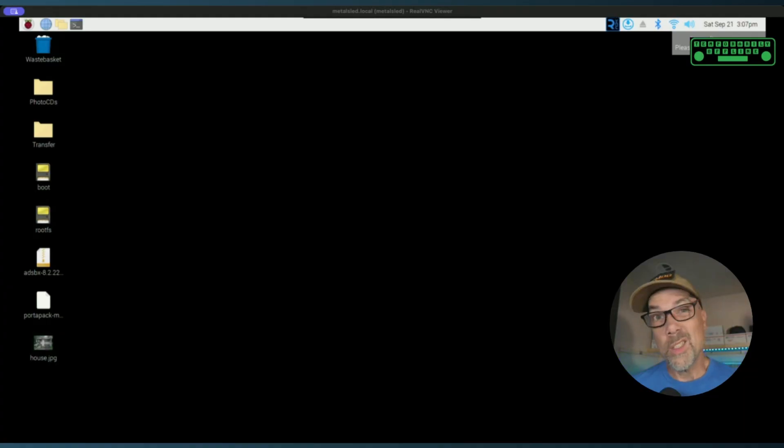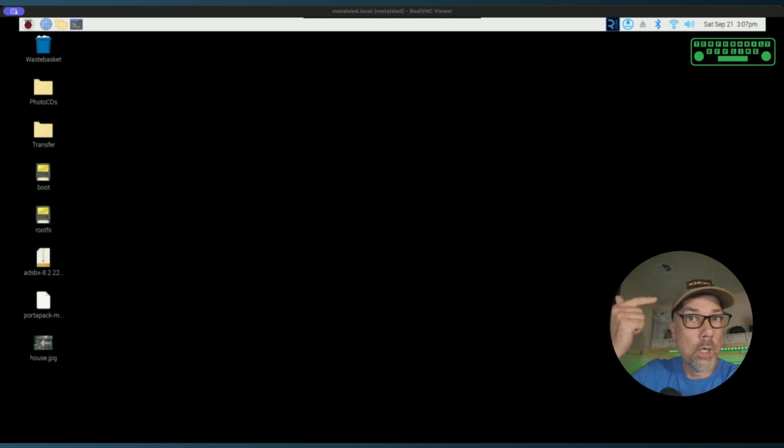This is the one I have, and I'll probably get another one — you know, radios and addiction, all the radios all the time. This is my Raspberry Pi desktop. I'm taking my USB-C cable and plugging it into my Meshtastic radio. Next up, we need to use a Chromium-based browser: Brave, Chrome, Chromium, or Edge. Don't use Firefox — Chromium-based browsers have serial port communications built in, and Firefox doesn't as of the time of this recording.